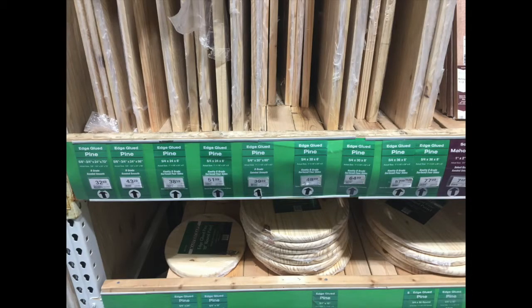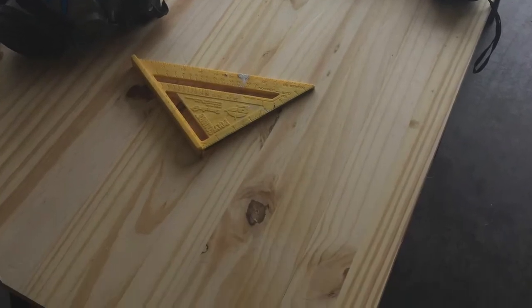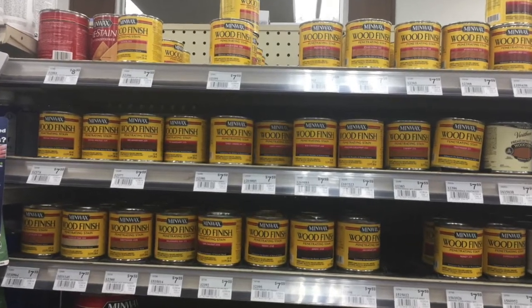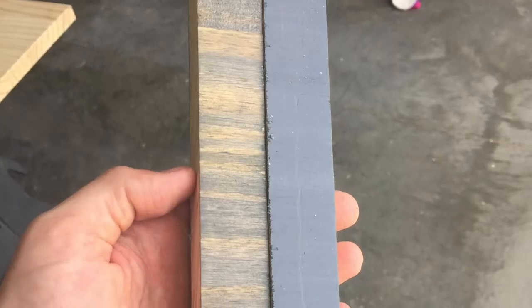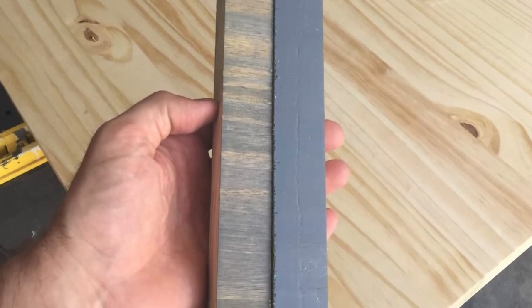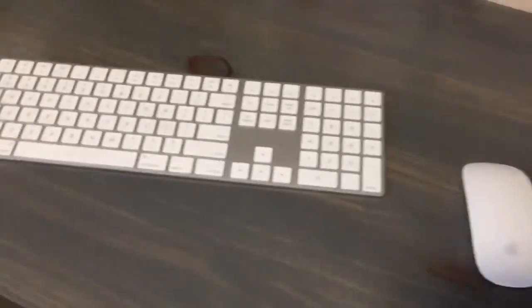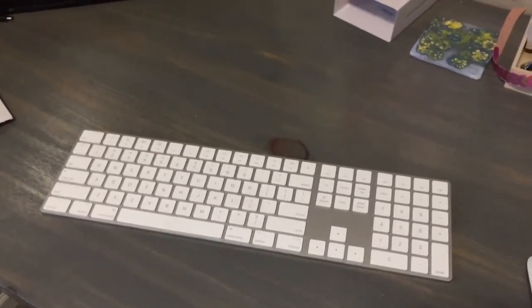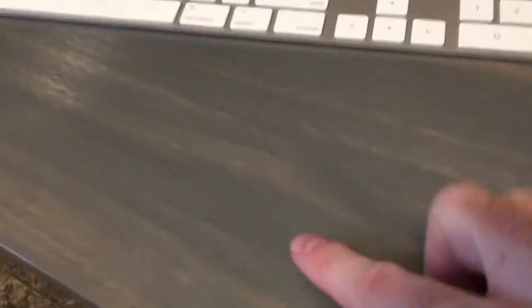With those in place, we can go ahead and start to talk about the tabletop. What workspace did we want to have? I went to the hardware store again and got some pine. There are lots of options, of course. We opted for pine and wanted to get a stain, not a paint. We did some test samples and decided which pattern we liked. We ended up going with a gray — I'll put a link in the description below if you're interested in this particular color. We went with a semi-transparent stain, and then we put some sealant on over it that's for interior purposes only, which gave it a really nice, very durable seal and strong-looking finish.